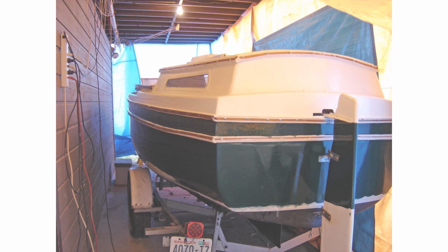Here's a view from the stern in which you can see the rudder. The rudder needed to be removed for trailering this boat, but it was actually quite easy to slip it out and back in position as needed. I opted to steer the boat with a rudder rather than with the motor itself because I wanted the motor well to be filled with removable fiberglass foam blocking that filled in the bottom of the well in a manner that provided a nice, smooth, fair bottom surface for the boat in the area of the motor well. I didn't want the well to create an area of turbulent water that would considerably diminish this electric boat's efficiency.